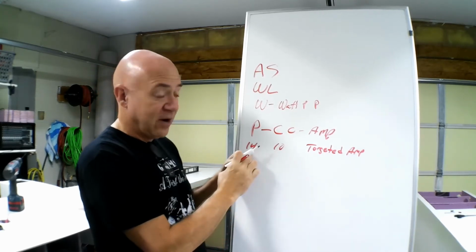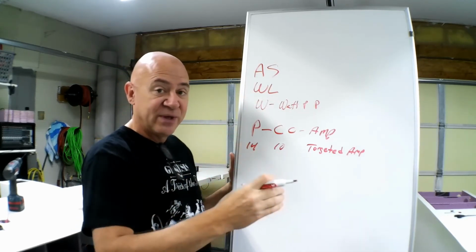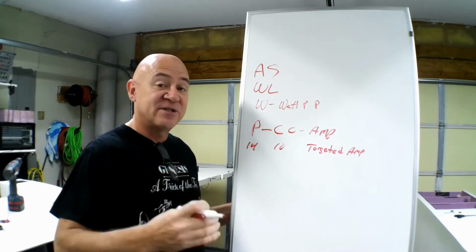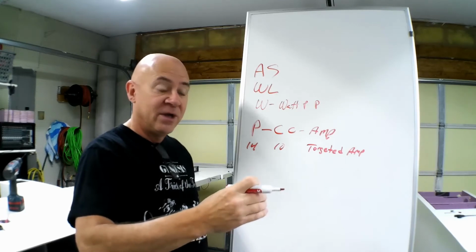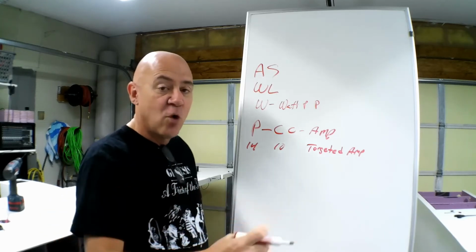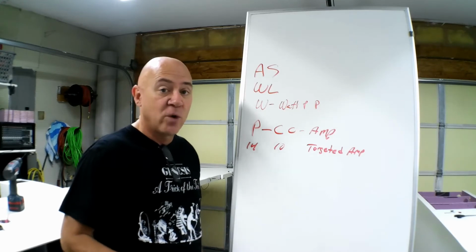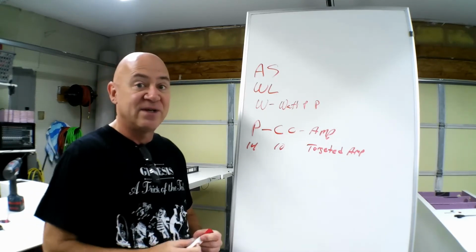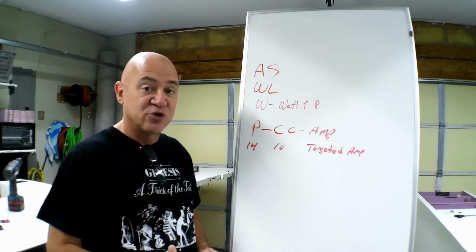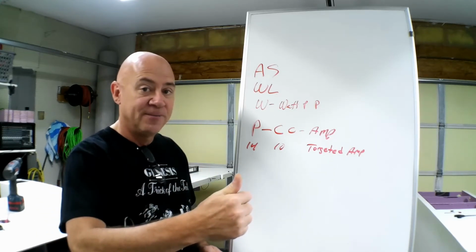But keep in mind, the higher the pitch, when you bring the throttle curve down, you still have a high pitch at the mid, giving you good, decent airspeed at 1/2 and 3/4 power. With a low pitch prop, the moment you throttle it back, you may not have enough forward airspeed to fly the airplane. That's the reason some people are like, man, I'm flying the airplane at 3/4 or almost full throttle the whole flight, and it just feels like it doesn't have enough power. Well, what's the amps on your speed controller? If you've got a 100 amp speed controller and you're only at 80 amps, add pitch to that prop. Get that plane moving faster.